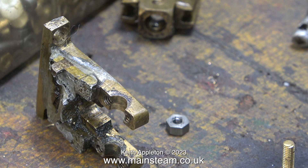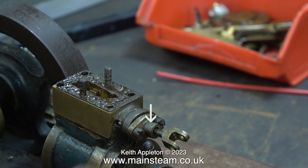This next part of the video shows why the engine could not possibly work, and here it is: the gland is fitted the wrong way round. The bit that sticks out should really stick into the large hole on the inside. But someone who doesn't really appreciate how steam engines work has put it together this way. This cannot possibly work — all that happens is the valve fork hits the bit sticking out and everything jams solid. Then the subsequent force used to attempt to turn over the engine has just broken everything, the motion bracket worst of all.